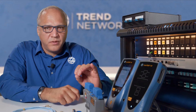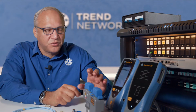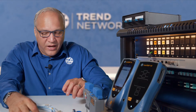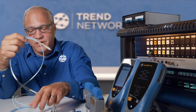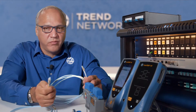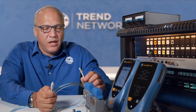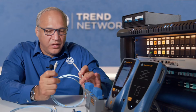The one jumper reference method is what's preferred in the industry. So to do that, you need to have a connector that can support having two different connections on your reference cable. So we need to have an LC at one end and an SC on the other end.